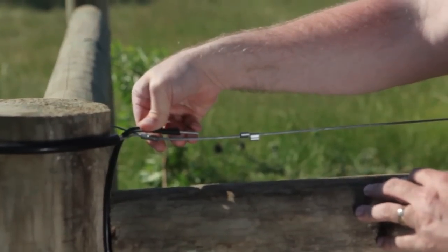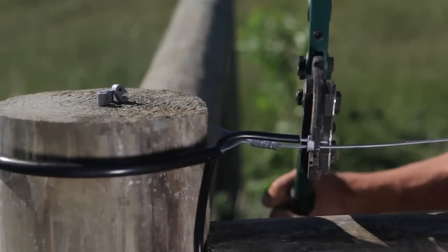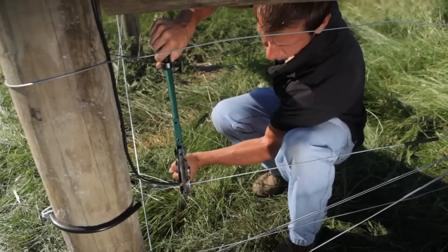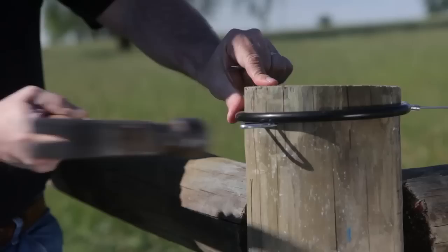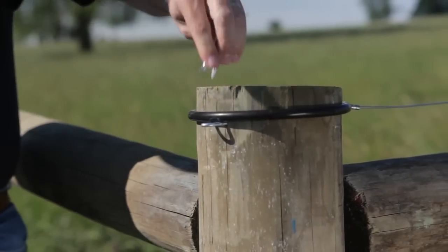If you forget to add additional crimping sleeves, you can also use a wire tap. Crimping sleeves are crimped onto the wire using a specialized crimping tool. They are made from high-grade aluminum with a carborundum grit inside to prevent the wire from slipping through. This connection provides the same strength as the wire itself. Position the sleeves directly next to each other for maximum holding strength. As a rule of thumb, use two to three crimping sleeves at friction points and for inline strainers, and four crimping sleeves for an inline splice. To keep the wire in its correct position at the end posts until final tension is applied, staple it in place.